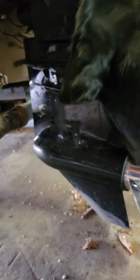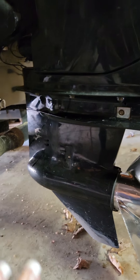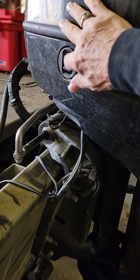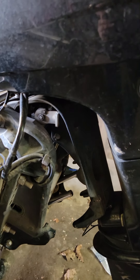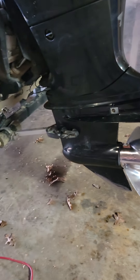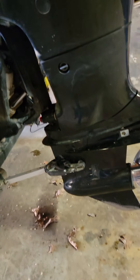If you don't lower it, the water that drained from the top is still going to be down here in this part, and it will freeze and it will tear up your prop. I can't afford to buy a prop every year. I thought that was a cute little tip to show people. It's just important to make sure you drain all the water out of your motor, because you sure don't want to have to buy one of these every year.